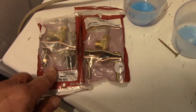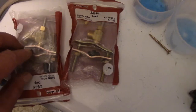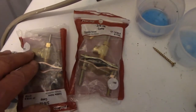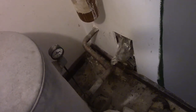This is really what I should have done from the get-go. I'll put this saddle valve on there, pierce the line, then open the valve and see how much pressure is there. I can just drain the pressure off first — might take about 5 gallons. This other line I can't really drain, but I can see how much pressure I'm up against, and that'll be helpful.